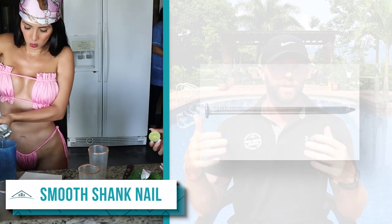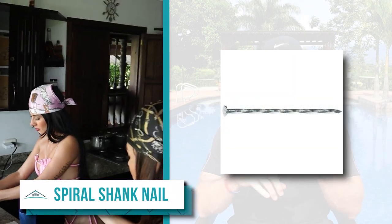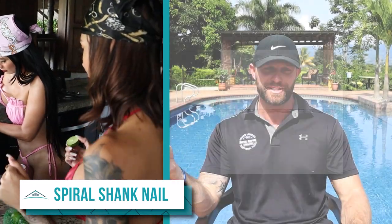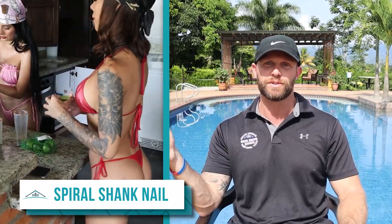Now, you have the spiral shank nail next. As its name implies, this is a shank nail that has a spiral thread and is able to spin and lock during installation, thereby increasing the withdrawal capacity, or it's harder to pull out. These nails are designed to drive easier into harder materials while also providing a better withdrawal resistance than a smooth shank.